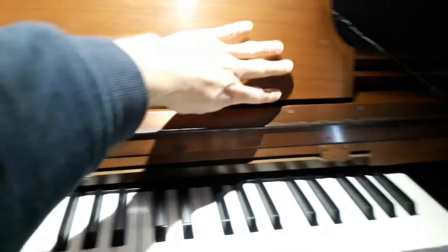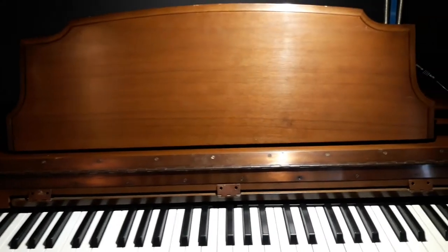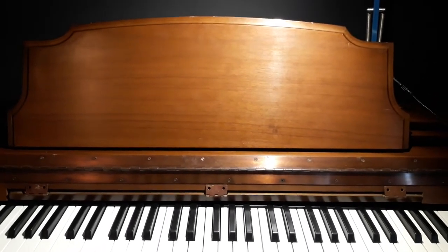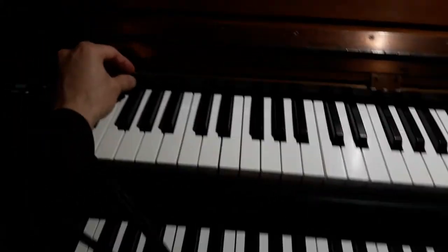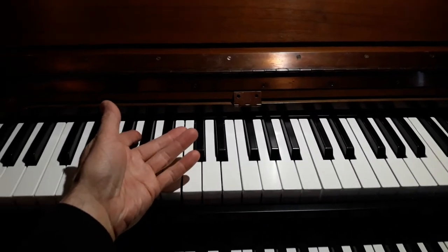If I slide this back under now, you can see it slides under quite easily into position. There's enough depth here in the remaining timber to hold sheet music and most hymn books — a very large hymn book may not sit quite so well. But this way I keep the integrity of the look of the instrument, and this can be removed, taken away, and the top cover folded over. Otherwise, if I tried to make the original mounting locations work, there was no way it could be folded up without impacting or damaging the top keyboard.